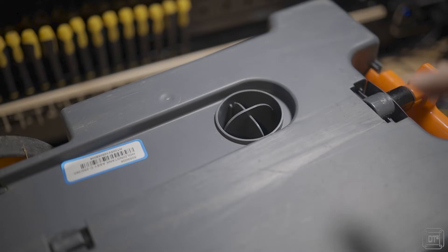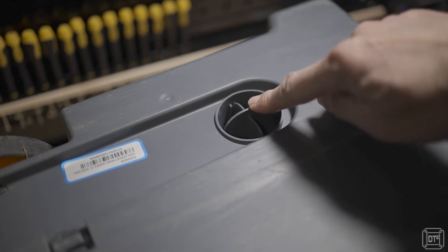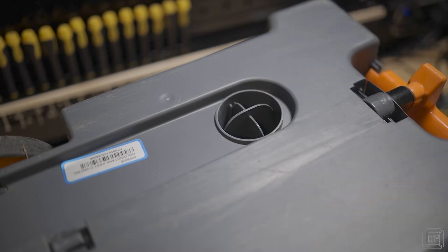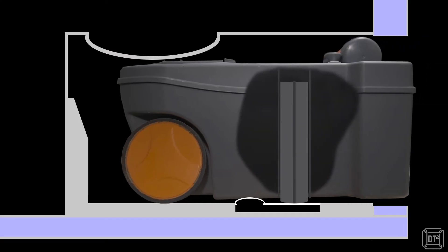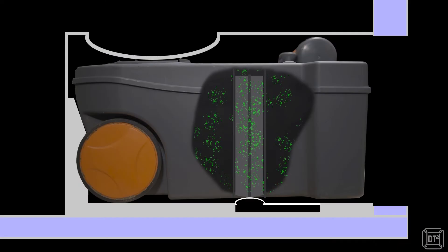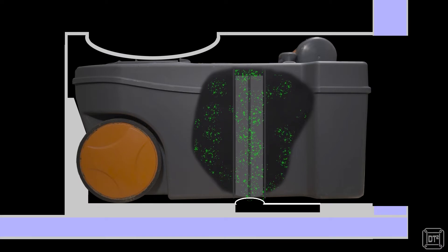Before I start, I'll explain basically how it works. On the base side of the cassette you may have noticed a hole which holds a cross-section beam. The beam can actually move up and down. On the cassette receiver housing there is a slight ramp in the floor, and when the cassette is slid into position the cross-section beam is pushed up. At the top of the beam is a seesaw arrangement to operate a valve, and all of this basically means that when the cassette is in position a valve is opened, allowing any pressure buildup within the cassette to be released down the same tube.